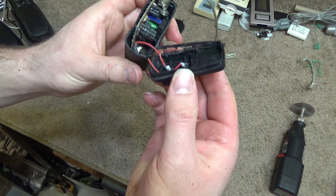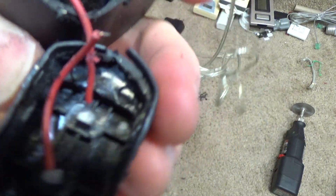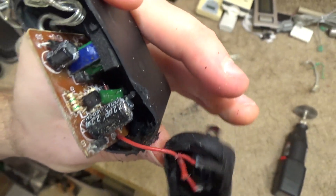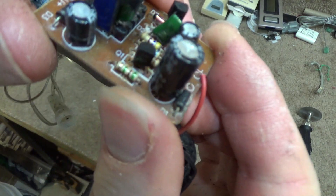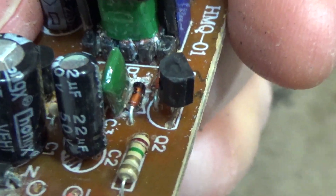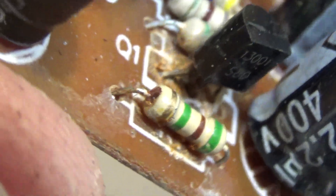Here's the inside of it. The prongs look like they're kind of separate from the rest of the board, although you can clearly see there was quite a bit of oxidation taking place in there. That's not good. I don't think that would have caused it to break — I don't see any signs of obvious failure in here. Right there you can see there's some water damage. Lots of things are corroded on this board.